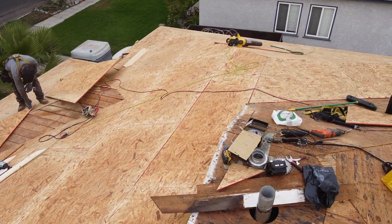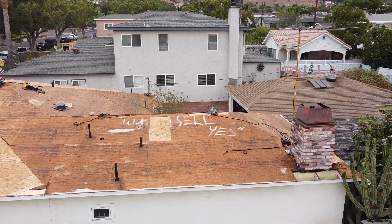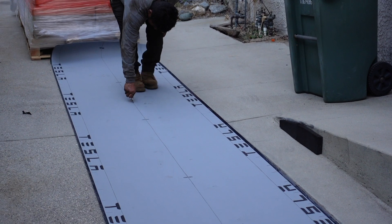The back side already had the plywood, so that's great. Day two: plywood on the front and the back portion. The back portion, which is an addition done in the 70s, already had plywood — no need to put it on there. The next step is going to be to put the underlayment — it's a peel-and-stick film. They're not putting nails into it directly. Whenever they put nails, it'll be for the mounting plate for the glass itself. The underlayment works like tar — as soon as a nail goes inside, it bonds and locks itself together, so any nails that go into it, you're going to be fine. That is actually the most important part to keep the roof from leaking.